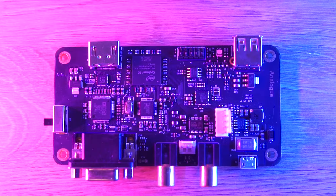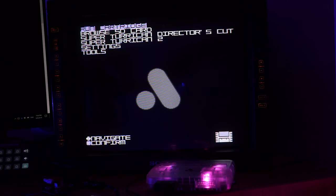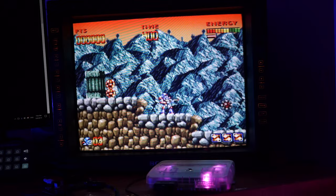First teased over a year ago, the DAC, or Digital to Analog Converter, allows the hitherto HDMI-only SuperNT and MegaSG to connect to analog monitors like CRT TVs and PVMs. It accomplishes this by switching the consoles into a mode that feeds data from the HDMI port, allowing the DAC to bypass internal scalers and produce analog video with zero lag. This gives your analog consoles true lag-free video output to CRT monitors in the console's exact original refresh rates.